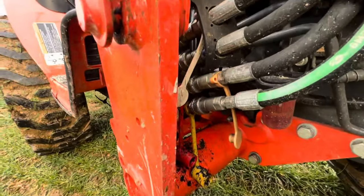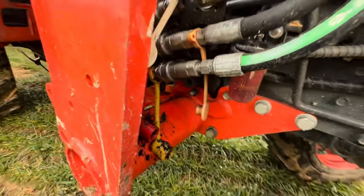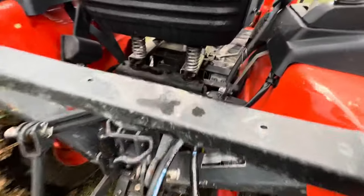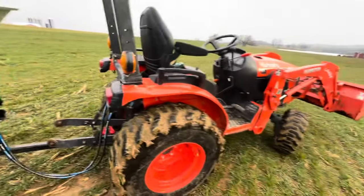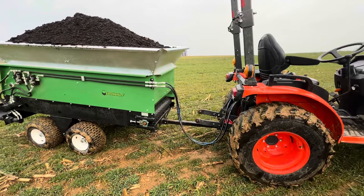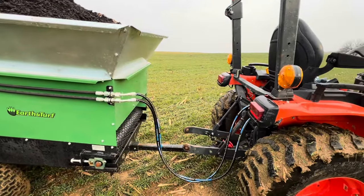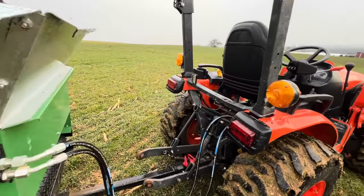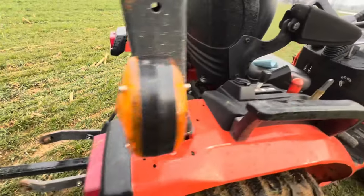These fittings over here are similar, however these ones are actually a hair bigger. It just depends on what you've got. Some people run these hydraulics from the front end loader. We've got the rear option mounted. And then on most bigger tractors, you're going to have the option for actual fittings for farm equipment. So that's typically what we're sending out. It can be complicated, but it doesn't really have to be. You've got one line out, one line back.